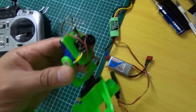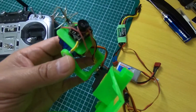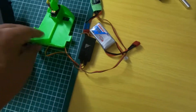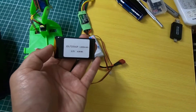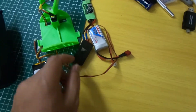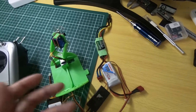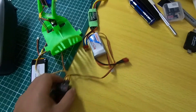This is my old FPV setup that comes with the video transmitter — it's quite cheap, I believe it costs around less than 100 ringgit. You need to power this with a single-cell lithium-ion battery, so I power it with a single-cell 1300 milliampere LiPo. You can just connect to it, and it will transmit video and audio. This radio transmitter can transmit up to 200 milliwatts, which should be more than enough for general flying.